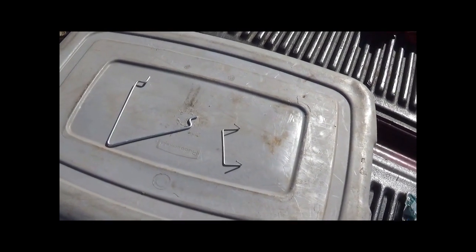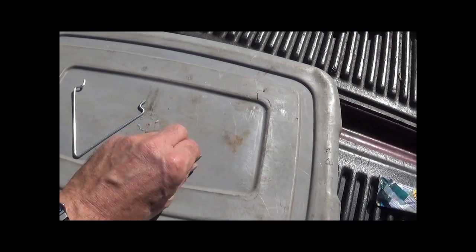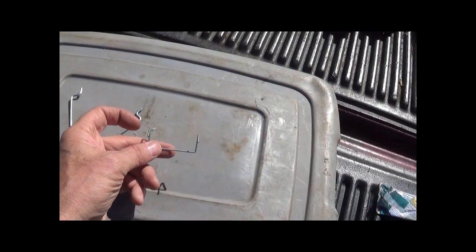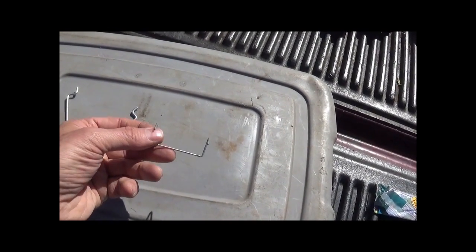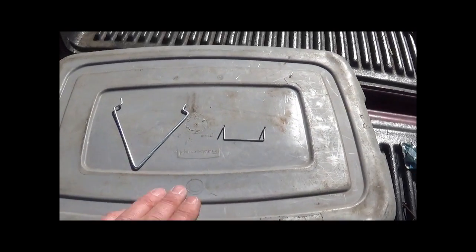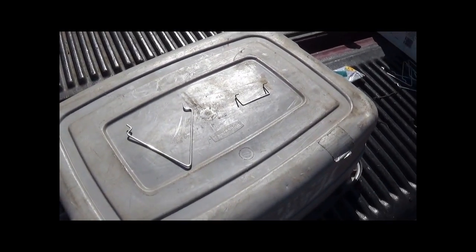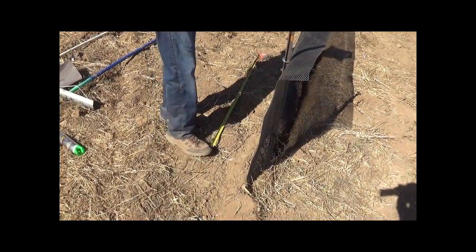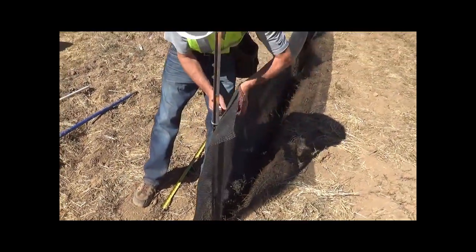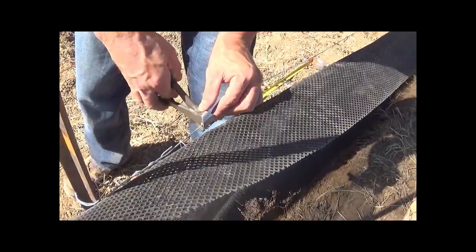The next step is to put on a couple of wire accessories. One is the climber barrier bracket, which goes over the top and keeps the climber barrier in place so the wind doesn't blow it up. The other is the guide wire clip — it pushes through the e-fence and crimps to the guide wire, keeping the fence stable so that when it's blowing in the wind the fence can move and absorb energy but still stays in place. Both accessories go every three feet. Russ calibrates his step so he knows the distance without constantly measuring. The clips are pushed through the fence and crimped off using a wire cutter.